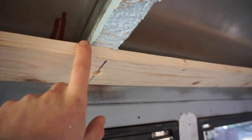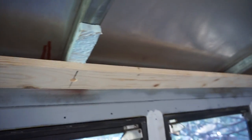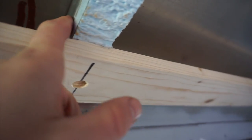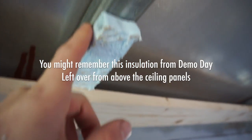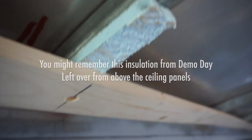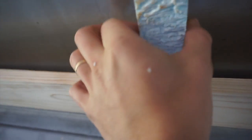On to more experimenting. I was worried about thermal bridging between the metal ribs and the wood. Some people were saying one-half inch rigid foam board will just compress. So I took some of the stuff that we had out — this is actually cut to between half inch and three-quarter of an inch. Luckily it's the perfect width. So I'm going to see if that compresses enough.